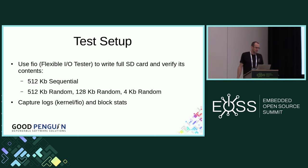Then we set it up and waited — and this wait was really painful, with all the fear, uncertainty and doubt kicking in. We ended up with three clusters. We initially started with 32GB cards, and when they weren't failing quick enough we switched to 8GB cards. When they weren't failing, we switched to 2GB cards and changed the test each time. It was a really good learning process. Eventually enough cards failed and we were able to produce a really beautiful graph.